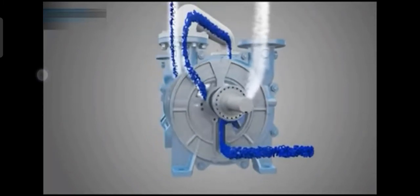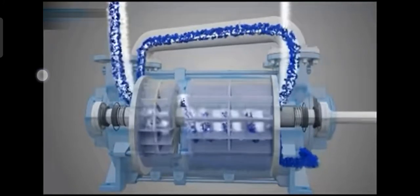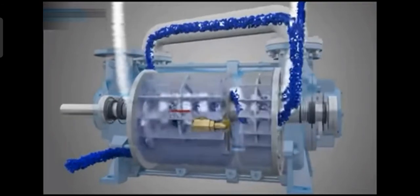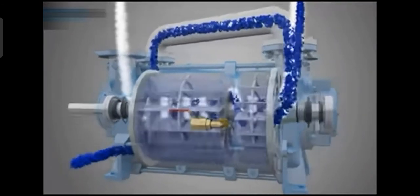The pump's axial suction and discharge ports are exposed to the void, but are separated by the impeller blades and the ring of liquid. As the process gas or vapor is drawn into the pump through the suction port, it is trapped between the impeller blades and the liquid ring. The rotating blades enter deeper into the liquid ring, progressively reducing the entrapment space